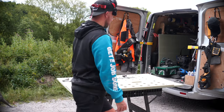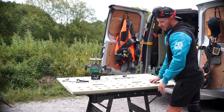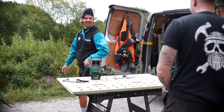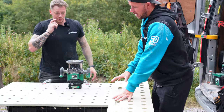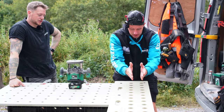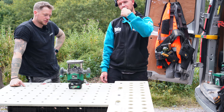We've got to the end — just the last two rows to go. You can see we've got about a 3mm margin. I reckon that's down to how square the board was cut in the first place. The bonus with this CNC Pro jig is not only can you go the landscape way, you can also go the portrait way. So we need to get another two rows on this side in order to match the left-hand side.